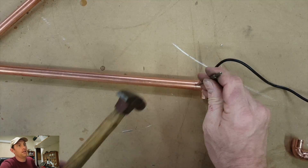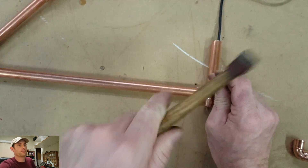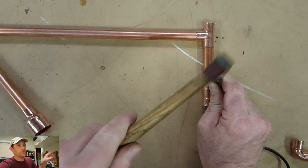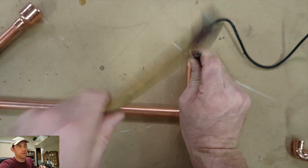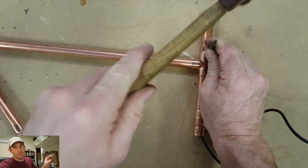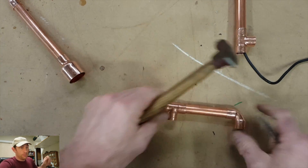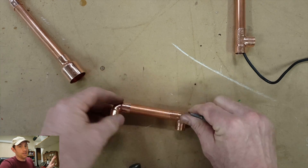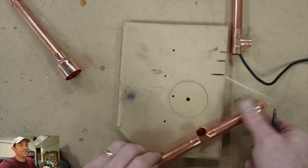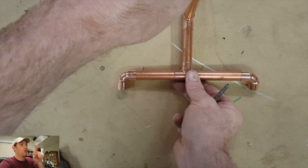Now we're starting to get somewhere — the neck is done and we're going to start working on the base. You've got to be really careful when you string this wire through all the fittings to make sure they're all arranged appropriately, because you can end up doing all your solder work, gluing the LED in, and then find out the USB fitting on the other end won't fit through. So once you've strung it, it's done. Make sure you do the right order — I only say that because I failed on this. I had to rewire it because I strung the fittings through the wiring incorrectly.